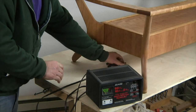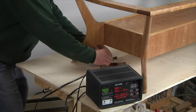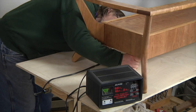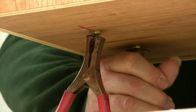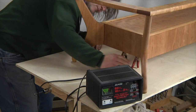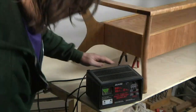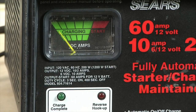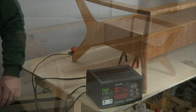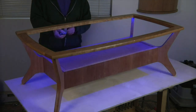To recharge the battery using a regular auto battery charger, first flip the switch that disconnects power from the LED control box. Then attach the charger's leads to the screw terminals, making sure their polarity is correct. Make sure to set the charger to its lowest amperage setting, preferably 2 amps or less. Then plug the charger in and leave it on until it indicates that charging is complete. Once fully charged, the battery in my coffee table will run the light strip for several hours, or even longer if the LEDs are dimmed.